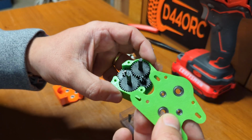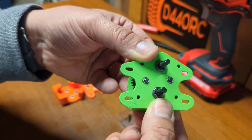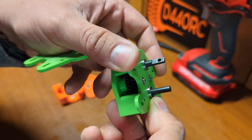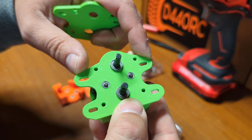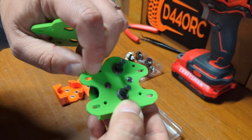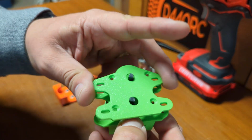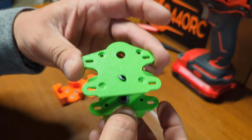These plates now go together, but just for simplicity, we're going to mount them separate. So it's going to go there. And then this one has a little space there to mount the side of the bearings that span out from that plate. So this plate is plain, and in the files you can also find the DXF version, which allows you to cut this plate in carbon fiber, aluminum, or anything. You can send it to SendCutSend and get it in a stronger material if you want something that's more durable. So far, I've been using the printed one in PETG plus this additional one that's to shape the screws, and it's holding up pretty well.